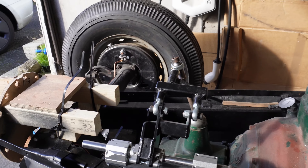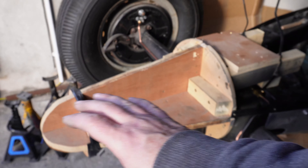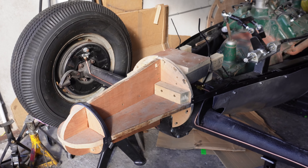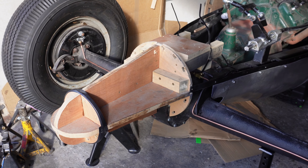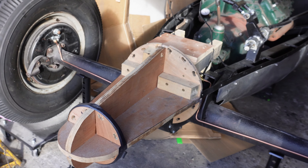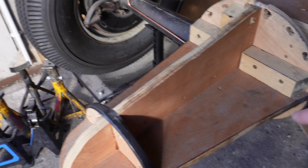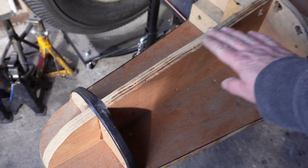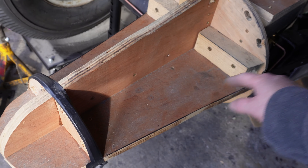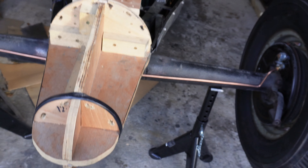The next thing I'm doing is making the tail cone. I've been putting it off because I thought I'd let my metal working skills improve first. I made an aluminium musical instrument just to see if I could, so that was smaller scale metal shaping. You can see there's a slight convex — it's not just a cone with a rounded end, it actually curves in slightly. So I'm probably going to make it in two parts or even four parts welded together.